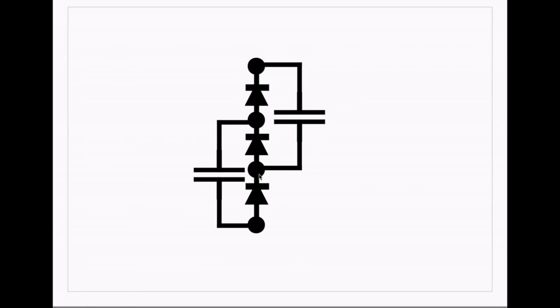All I've done is put these dots on here so that we can follow this. These dots represent the joining points — one, two, three, four — with three diodes. The things to notice: one goes to the capacitor, two goes to the capacitor, and remember one is the negative. Then three goes to the other side, and four goes to the other side of the capacitor. So capacitor here is joined at dots one and three, and this one here is joined at dots two and four. As long as you remember those, constructing it is really simple.